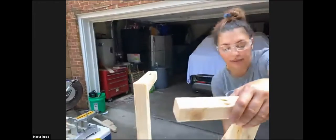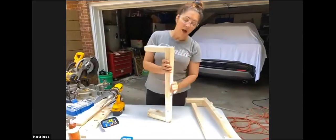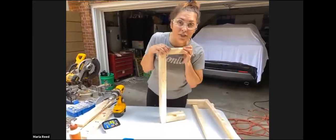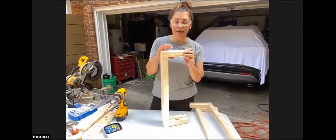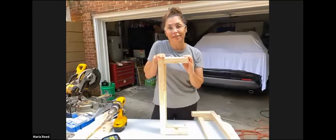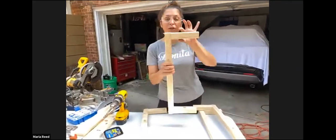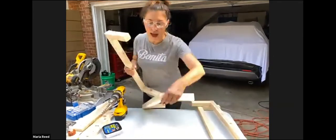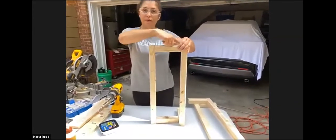Yeah, definitely. Okay. So what I'm going to do is secure the legs to each other. All 4 legs are the same cut, same size, so just make 4. All these were cut to 23, the longs. All of the center braces were cut to 6 inches. And the only ones that get the pocket screws are the 6-inch pieces, not the long pieces. I've already secured the 6-inch pieces to the long leg. So it looks like that. Now, because I already have a pocket screw, I can screw that pocket screw right into this side.